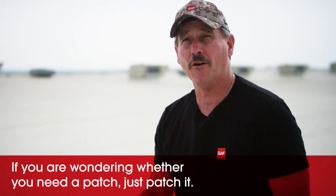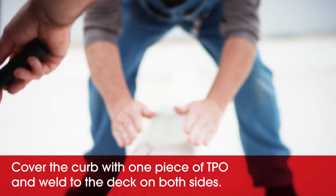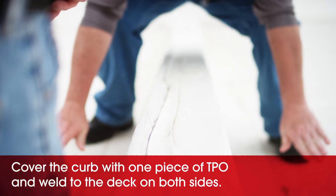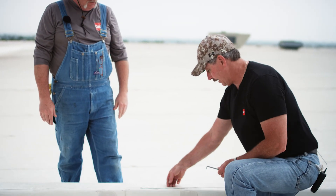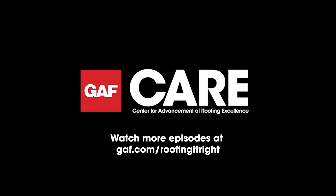If you're thinking about what you're doing, why would you use two pieces? Why not just take one piece, drop it over, and weld both sides? Save all that work. That's another way you would not have a problem here. And when you've got a weld with a crease like this — where it's rolled onto itself — where's that going to crack? Right there.